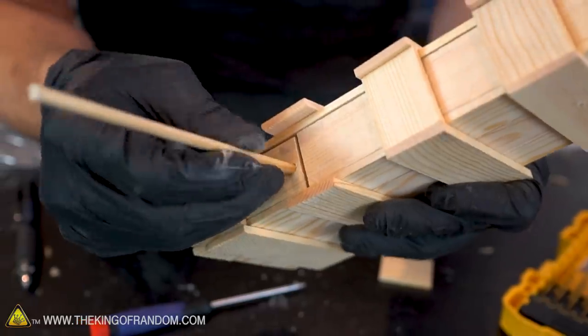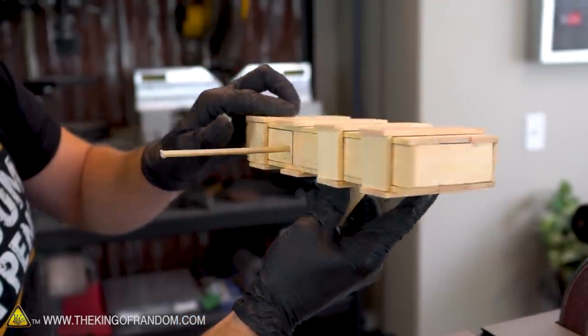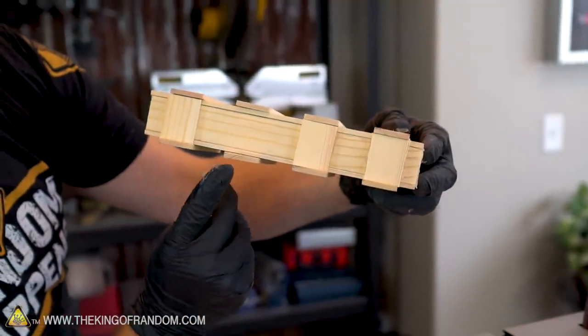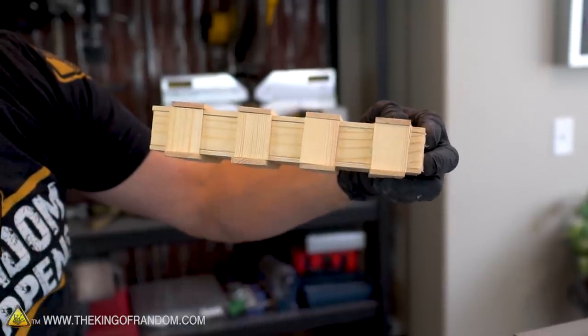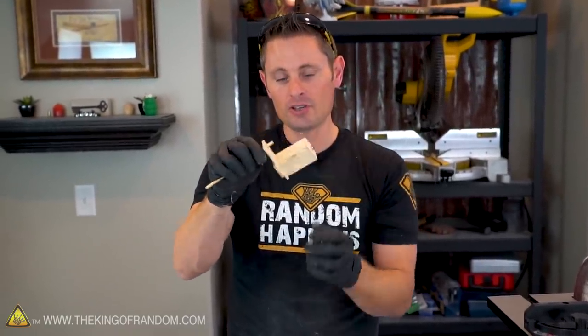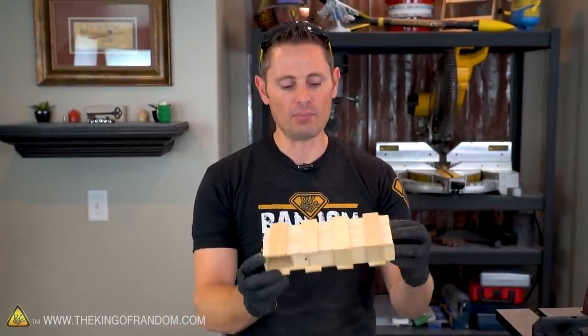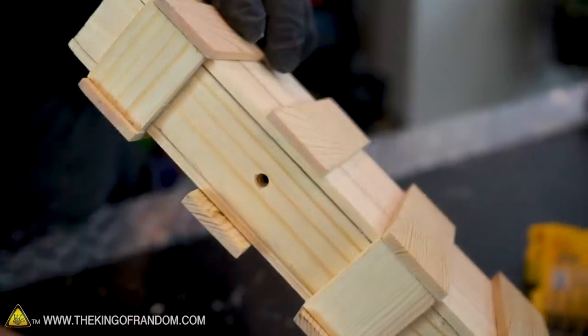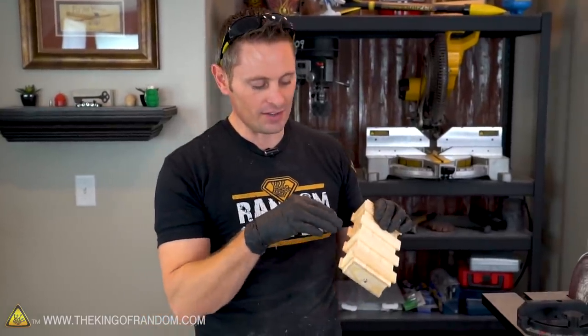Pushing the dowel in, it's a very snug fit — it's perfect. We're actually going to leave that in there and flip over to the other side. With the small mystery compartment in the back, you can see the panel that I have missing is the second one from the left. It is important to put this panel piece into place before we drill the hole. Once positioned correctly, drill a hole straight through it — you should penetrate three layers, which is exactly what we want. Take a little piece of the dowel, push it through the hole, and glue it in place. The hole for the panel and mystery compartment need to be as tight to the dowel as they can be because we're going to glue these together. The holes going into the box itself can be opened up a little bit wider — it actually helps if they're a little loose. Use the drill bit and get back inside there and open them up just a touch.